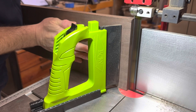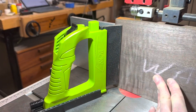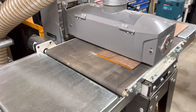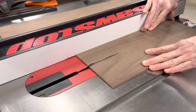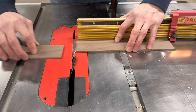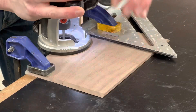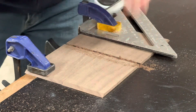I sort of built this box from the inside out, so the first part I made was the walnut divider. That started with re-sawing and drum sanding some walnut down to 3 sixteenths of an inch thick pieces. All the pieces were then cut out and mitered on the table saw. I taped the opposite sides of the divider tray together while cutting the dados, which worked really well to make sure that they matched perfectly.